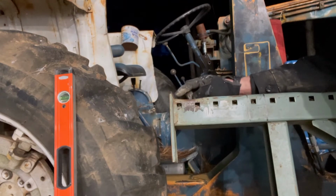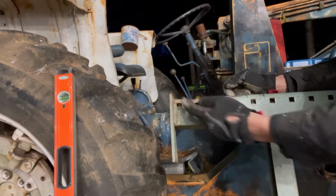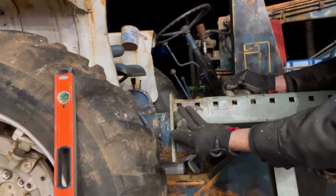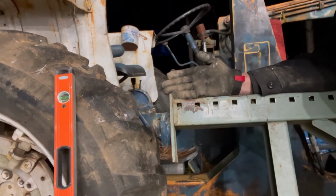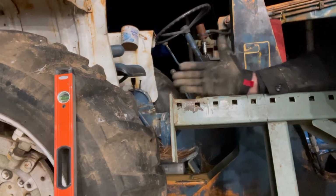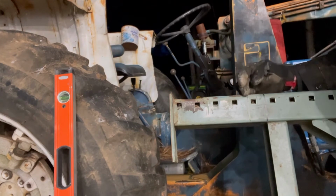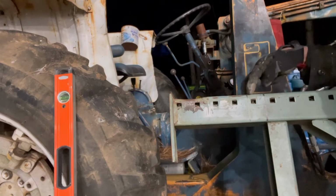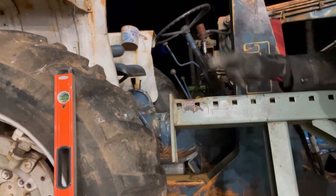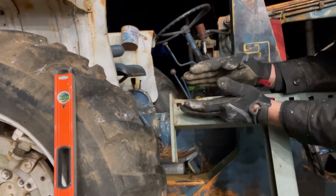What I'm going to do is I'm going to put the plate here, and I'm going to weld it lengthwise. And what that's going to do is this leg right here is now going to attach itself to a piece of straight iron. And that's going to reinforce this whole leg here. So if you were to just weld it here and just weld it here, see, what would happen was it would crack here, because now this is the load bearing here, and those are short welds. There's strength in welds, but it has to be able to transfer the energy, okay?